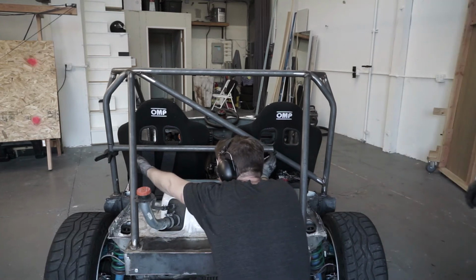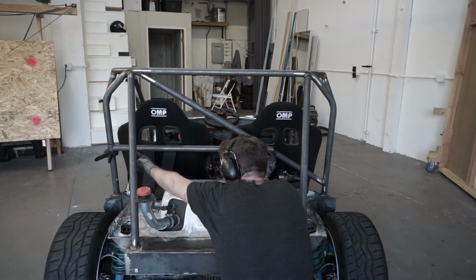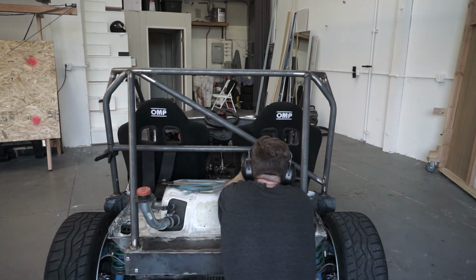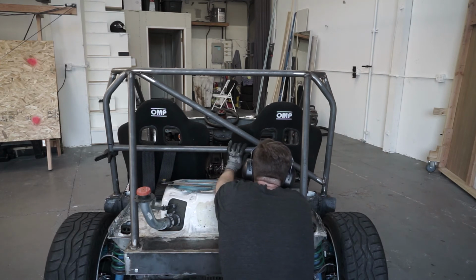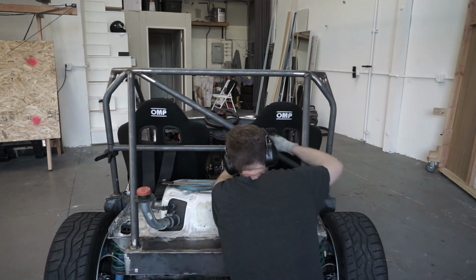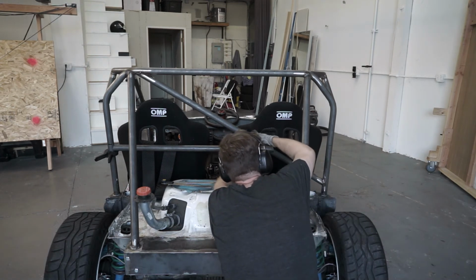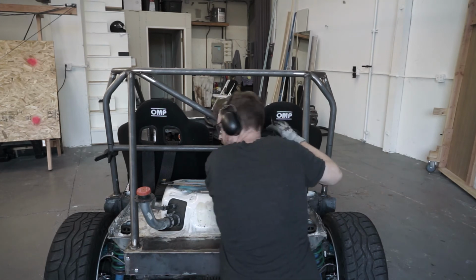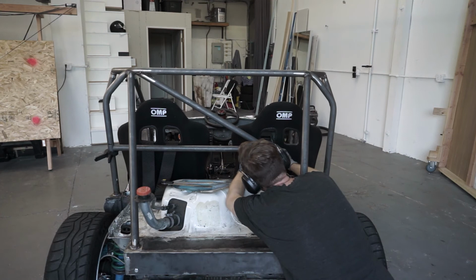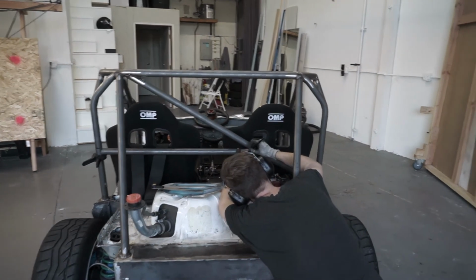All right, so our height is exactly where we need it there. And this is the angle that we need here, right? So now what we do is I want to draw the line of the intersecting pipe exactly where it needs to be. So I'm going to line that up, and that's pretty good there. I'm going to draw this line.